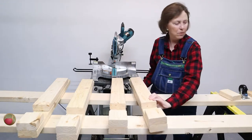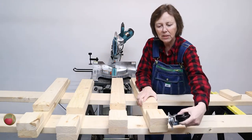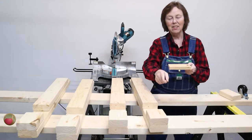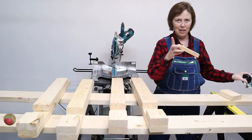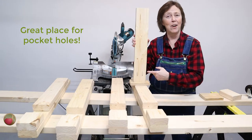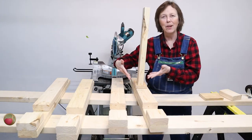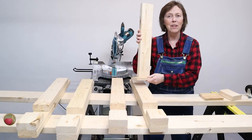Here's what I plan to do with mine. This caster has two dimensions, and one of them — the long ways — is about almost exactly the same as that board, so it's going to fit fine there. I'm going to take a piece of 3/4 inch plywood, cut it to that dimension, and mount the caster to it. This is a fantastic use of pocket holes — I can drill straight down into the wood this way, and then on the backside of that second 2x4, those screws are going to come in at an angle and cut across the grain. That caster hits a bump, it's not going to jerk out in any kind of way. This is very, very secure.